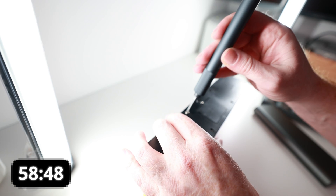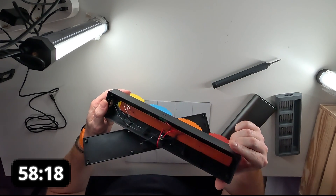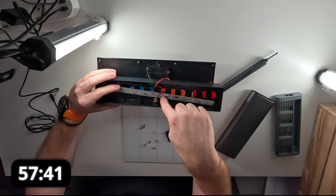So, 20 minutes to figure out the hardware. Basically we have LEDs, a button, and a tiny little PCB in here with a microphone. It doesn't seem too complicated. Disassembling — I think I broke it — but there's one cable going inside even though I don't see any lights inside. So we basically have hard-coded LEDs throughout. I wonder if I'll just use a WS2812B in here. Let's start with the board — I think we'll use an ESP32 with a WS2812B.